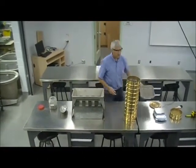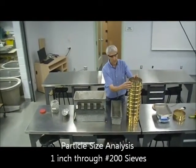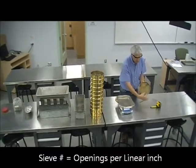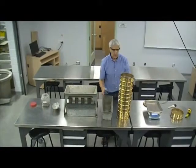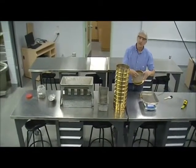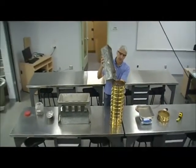Once this procedure is completed, we're dealing with a smaller amount of material. In our testing, we assemble a series of sieves ranging from the one-inch to the number 200 sieve. The number 200 means there are 200 openings per linear inch. We have the stack of sieves ready to go, and the procedure now is to carefully inspect each sieve for damage — there could be a tear in the mesh or material stuck from previous use — so you want to make sure you start with proper sieves. At that point, you're ready to pass the material through this series of sieves.